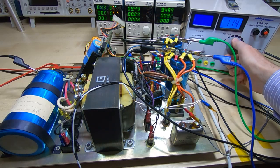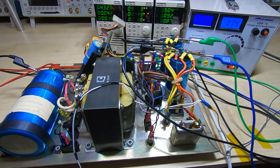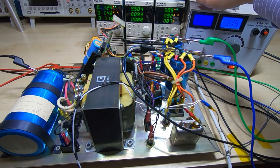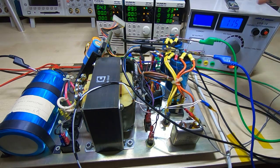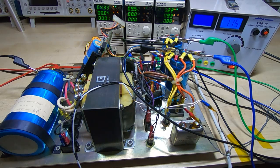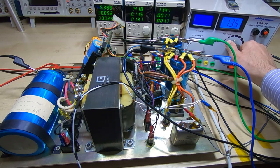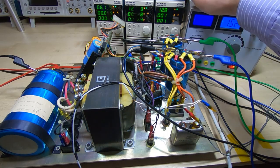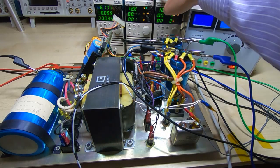It's just come on at 115 volts and the current's looking quite promising. On the electronic loads we're getting readings — we're still at half the rated voltage, so the fan hasn't started up yet. We're at 9.5 volts but they're holding fairly steady, and 4.3 volts on the other. No smoke, no strange noises or smells, so we'll continue to increase the input voltage. The fan is just starting to turn. Now at 150 volts we're up to 12.8 volts on both of these and they're very close to each other — none of these are regulated so they'll go up fairly high.